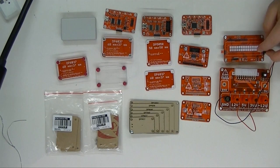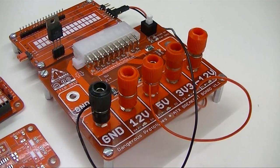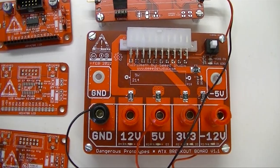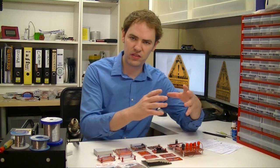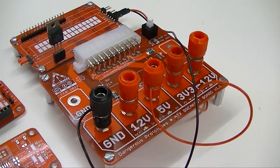Some new projects are also getting the treatment. Here's the PartNinja that's using a standard board, and here's the ATX breakout board which uses the Eagle maximum — it's not quite golden ratio, it's 100mm by 80mm. It's still a rectangle but a little larger than the ideal golden rectangle, and it does fit the Eagle maximum allowed size for free boards.